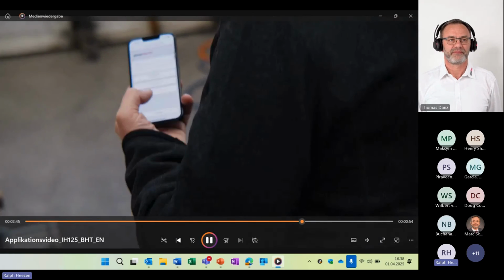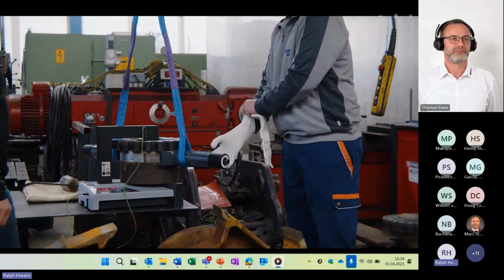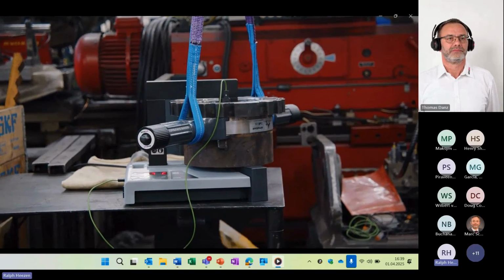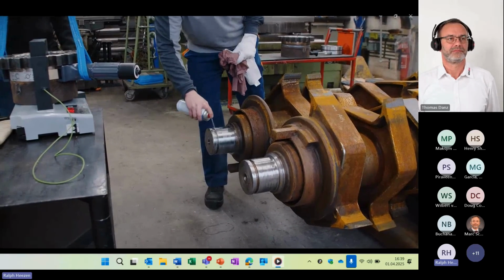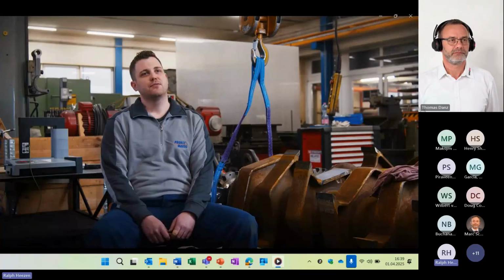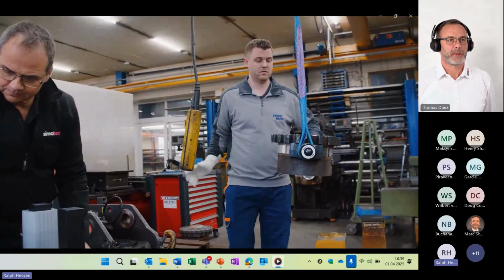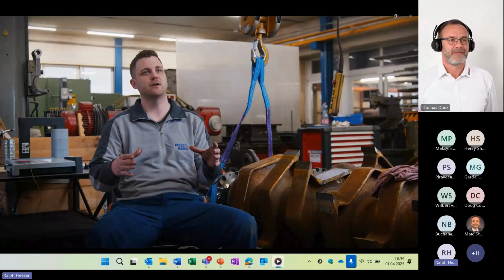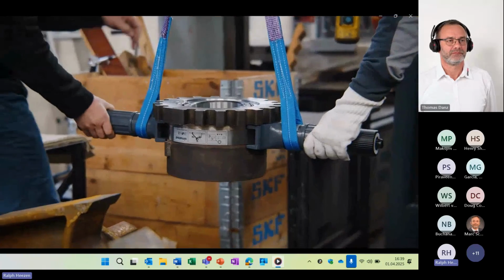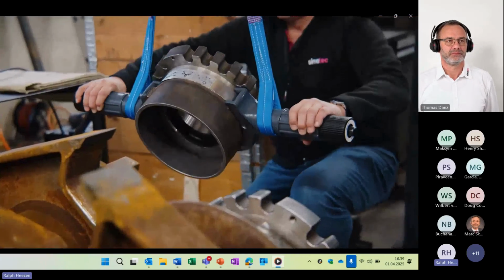Temperature difference does it start heating again? 4 to 5 degrees. For me, the advantage of the bearing handling tool when heating is clearly that you no longer have to guide or touch the heated workpiece directly. Instead, you can grip it far outwards with the BHT, hold it securely, and guide it well. This keeps you further away from the heat of the workpiece.